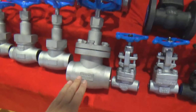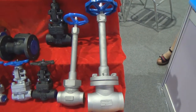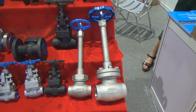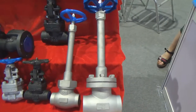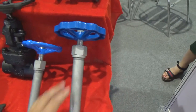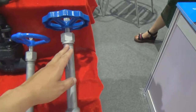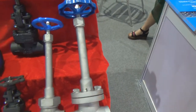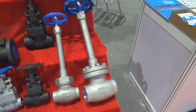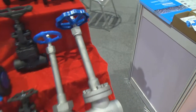Except for this kind of low temperature globe valve, we also have another kind of low temperature globe valve. This kind of low temperature globe valve can work at temperatures lower than minus 190 Celsius degrees. The reason why this kind of globe valve has a very long neck is because it is going to protect the packing in this area. If we don't have this kind of long neck and the packing is located at this area, the low temperature will destroy the packing. So that is the reason why we designed this kind of low temperature globe valve with a very long neck on the top of the valve.